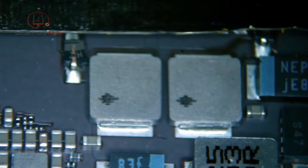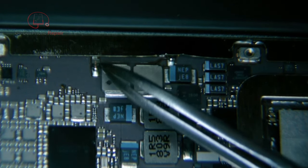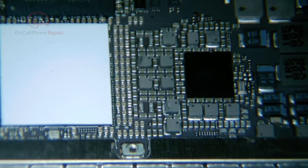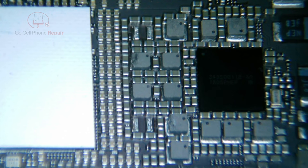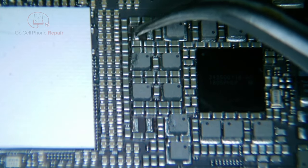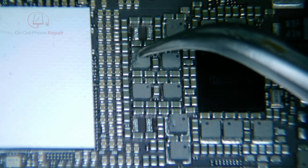These are the same diodes that they've been using for years, all the way back to the iPad minis, and I think even maybe the original iPad or the iPad 2. So they're pretty common. If we look over here, you'll see that between the CPU and the power management IC, we're actually missing coils off the motherboard. This is another thing about these very lightweight, somewhat flexible iPads — any tension on the surface will just cause these coils to pop right off the board.